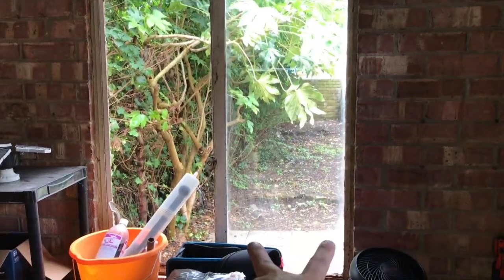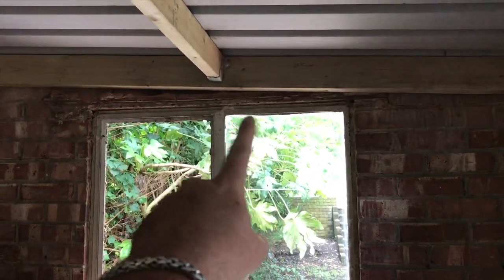The new windows are coming in soon — I've already put down a deposit for the fitter. I'm going for double-glazed laminate glass, so it will break if you really go for it with a massive hammer, but it won't shatter like normal glass. It's got shoot locks on it — standard bolts plus shoot locks either side of the frame for security. On this side I'm going for opaque smoked glass so it lets light in but you can't look in. The layout will be the same: one pane there, another there, that one opens up, and I'll have a little trickle ventilation system at the top for fresh air.